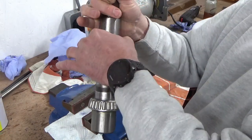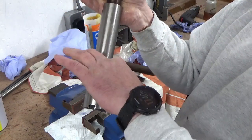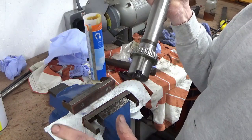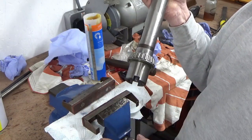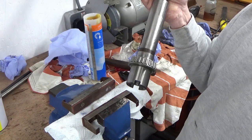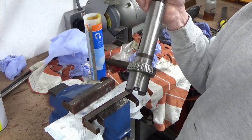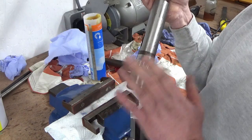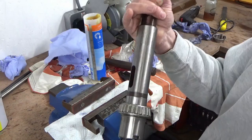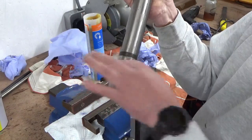I came out the other night — we got some real low cloud, we were actually in the clouds — and there had been a temperature change from cold to warm fairly quickly. I looked at my lathe where I've got oil on the bedways and the whole lathe had turned milky white. There was so much moisture in here that it had gone underneath the oil, lifted it off the bed, turned it into an emulsion, and the water was just sitting on the metal surfaces. I was out here literally wiping surfaces and they were just flashing straight over with rust. It's quite depressing at times, but it is what it is — I just have to stay on top of it.